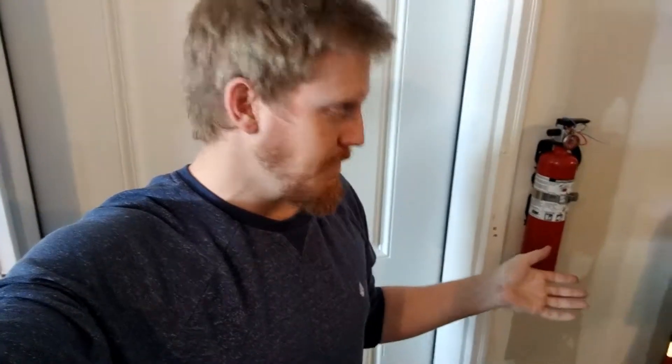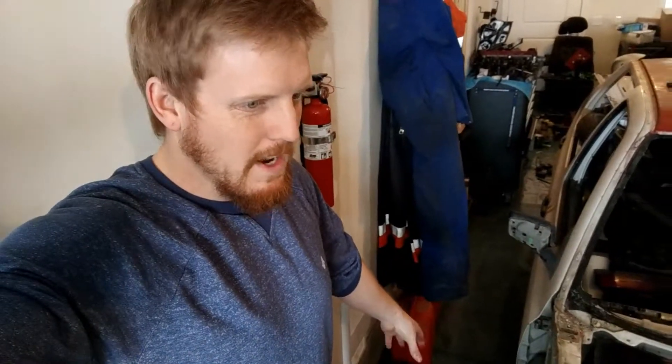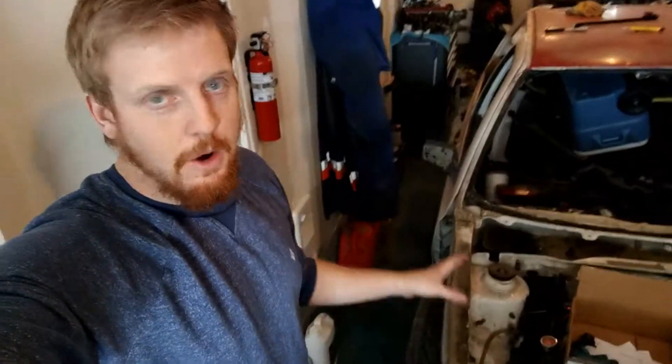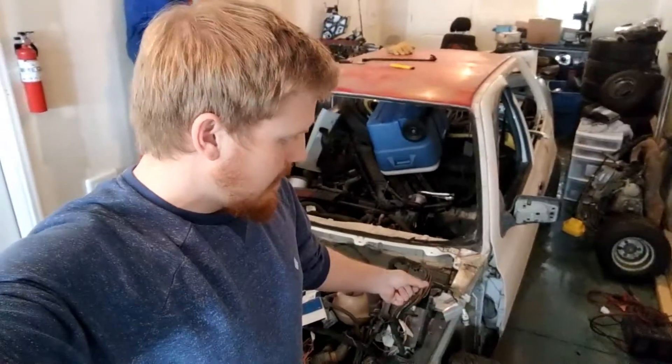I'm not sure how I'd have done it differently because I would have run out either way. Ideally you'd go really heavy with the first coat and get two kits, so that's about $300 right there, plus $150 for the top coat. I think the best approach is to find a white floor kit — the gray is kind of boring and probably wouldn't show the colors as well. White is hard to find because it gets dirty quickly and they don't sell a lot of it. I'd do the floor all white first, then a second coat of clear coat with blue mica powder in it, and use isopropanol with a different color of mica to do the effect.